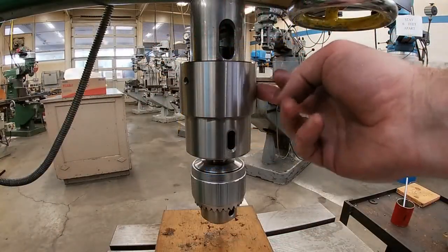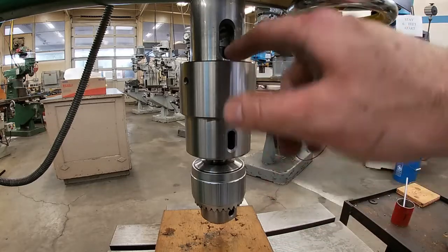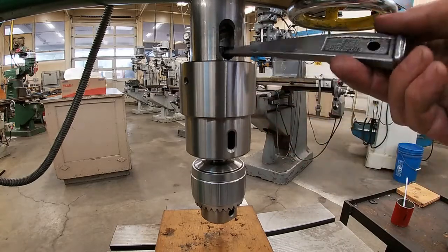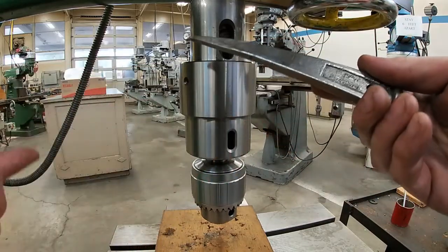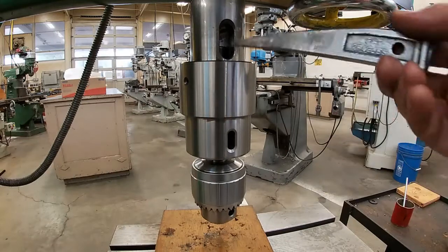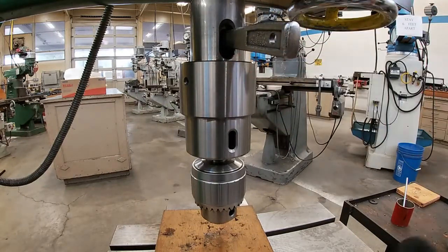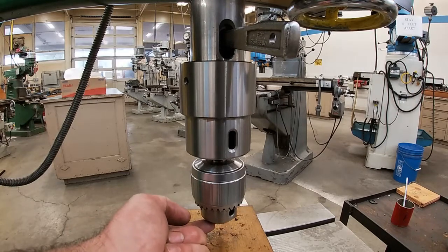Let's talk about how to unload a tool while we're on the subject. I've lowered the spindle down and I have my port window lined up. So now I can take a drift, and normally these have a slightly better radius on the top, but this one's been loaded in incorrectly. The radius side should go up.